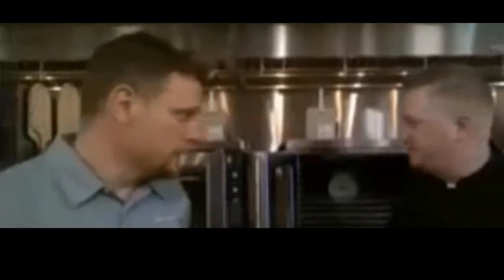And more importantly, when cleaning the outside of the oven, don't spray that with a hose either. This happens more times than I care to admit, especially on a month or two month old unit that is getting cleaned for the first time, and then they're wondering why it doesn't light. No cleaning with a hose, no using wet rags and soaking everything. It is an electrical appliance, even on the gas. There are some electrical devices in there. The number one killer of electrical components is going to be water, so we want to keep that away from it. So we're cleaned, we're good.